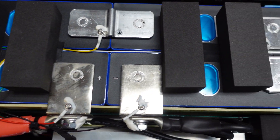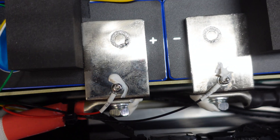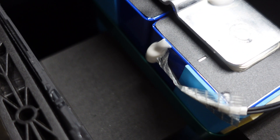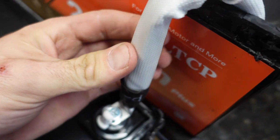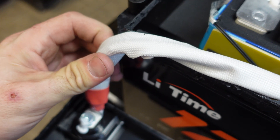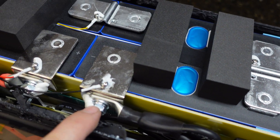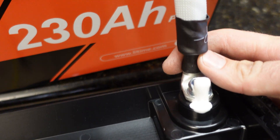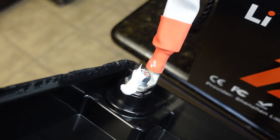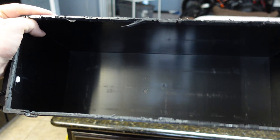Familiar battery smell — they all have that weird smell. If you look right here, there's two layers of plastic that attach with glue on both sides, giving this thing its water tightness, and you can see they used a ton of adhesive. The cells are in this orientation given the length of the battery. We have laser welded terminals — good to see that. Balance wires look okay. There's the high/low temp sensor. It's hard to tell but in the sheathing — which is really nice because it protects the wires from heat — I can feel there are many conductors on the negative side, looks like two, maybe four or six gauge conductors inside, going right to the negative connection.